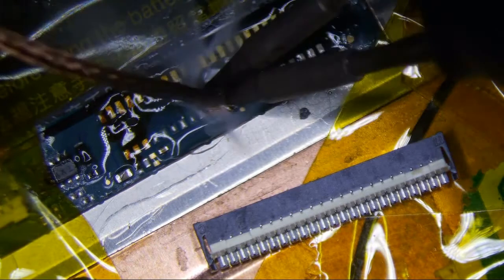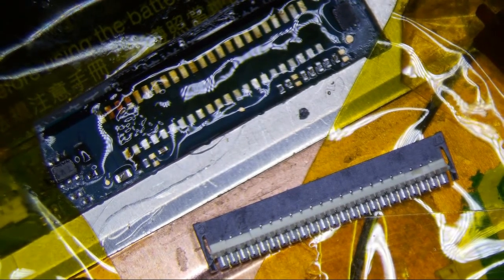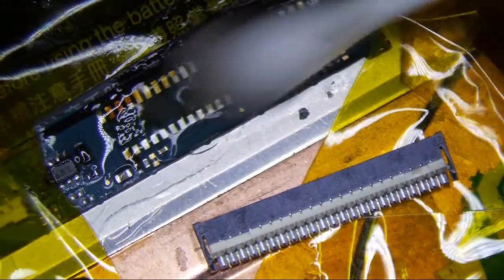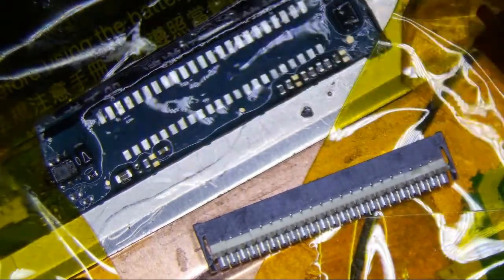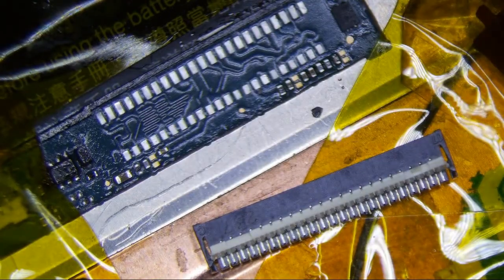That way you don't burn your fingers or anything, because the wick is super hot. Okay, that's it. Clean it up one more time. Get some new flux. And let's reapply some leaded solder. Actually, I probably don't even need leaded solder. So I'll probably just go like this. And I will start soldering now. So let's put a little flux on this puppy. And this way.